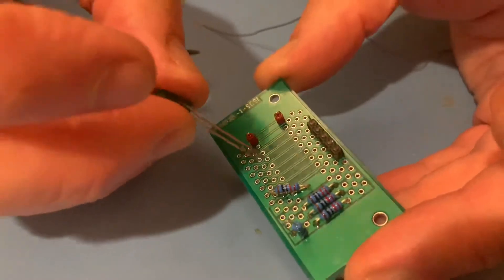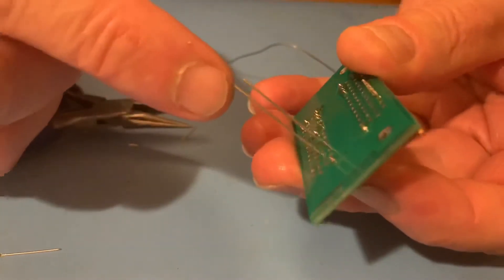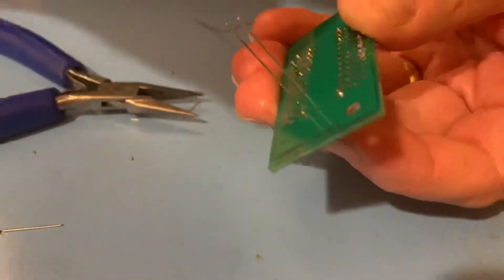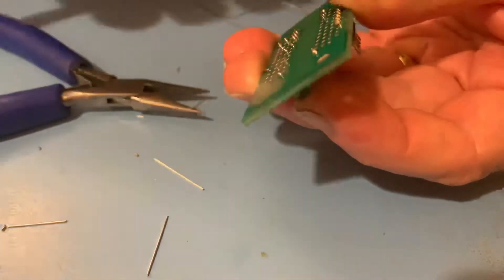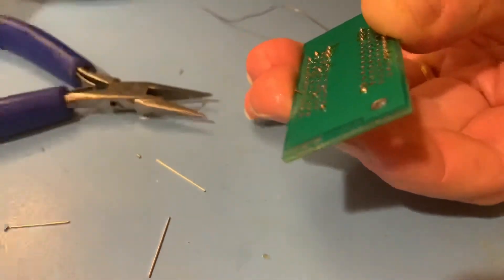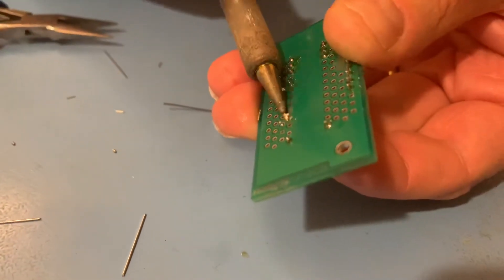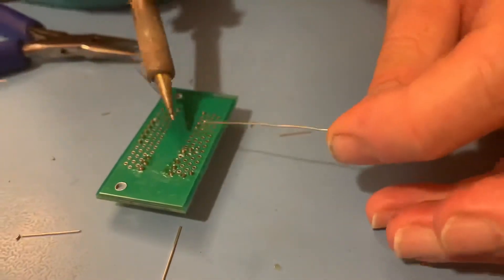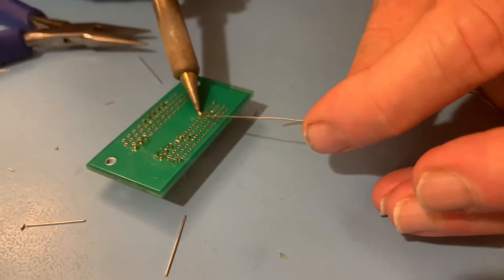Now I'm going to show you this LED — just pop that in. I've seen some people leave the legs really long but you really do risk it: if one leg touches the other it's going to cause a problem. That's why you should always cut your legs down — you rule out any potential problem in the future of the two legs touching each other. LEDs obviously have a polarity, but this is just a breadboard so I'm not worried about that on this one. Solder it in so it's nice and flat to the board.